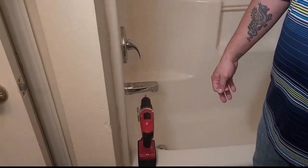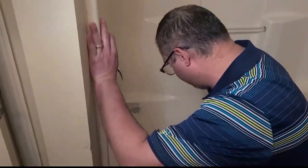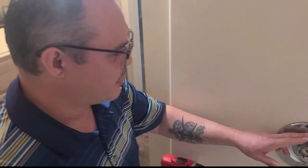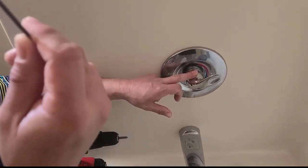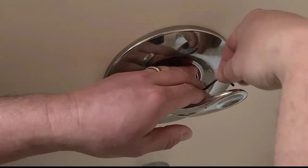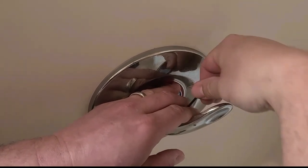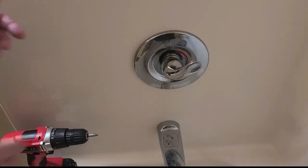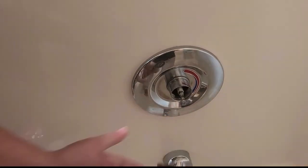When we're taking off this little lever here, there's a little screw in there that you definitely don't want to fall down into the tub drain. So you can either put a towel down, or in my case I'm just going to close the tub drain. Now we're going to take this lever off — you're going to need your Allen wrench. There's a small screw in here; get the Allen wrench in there and turn it. There's the little screw — you definitely don't want to lose that. Take off the lever; you've got to give it a pull. And there's the lever.